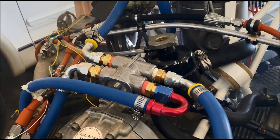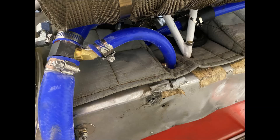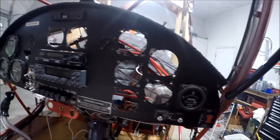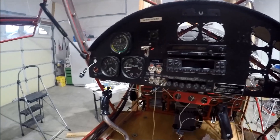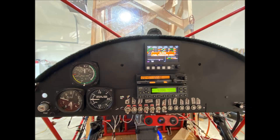To help with temperature, I decided to install an oil thermostat, and it's doing a pretty good job. I also added a thermostat for the coolant. Both thermostats work really well together, especially for low winter temperatures. This is the process of the panel change — all gauges were removed, fuses swapped for circuit breakers, new cabling and new routing — and this is the end result.